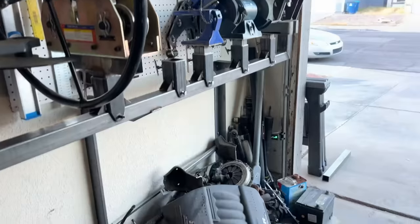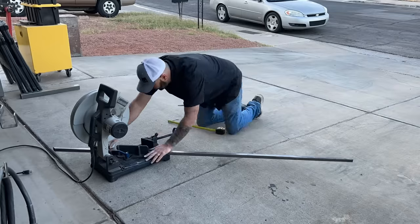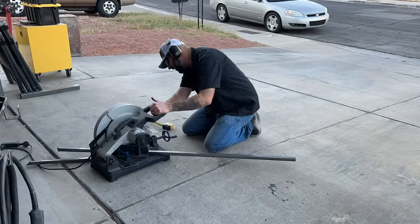The last thing I'm doing to the rack in this video, anyways, since I decided to put all the tools on a 6-foot section, it's just these 2 wall brackets that's holding the whole thing up, and it's pretty thin angle iron. So I'm gonna put some diagonal braces on those so that it doesn't fold and collapse, because that would suck, but that's pretty much it. And then I think all that's left after that is to drill and tap the common stand, and it'll be ready to use.